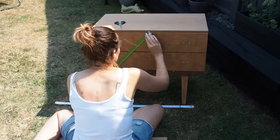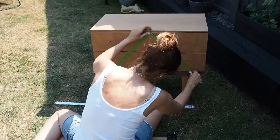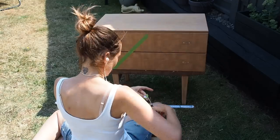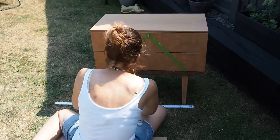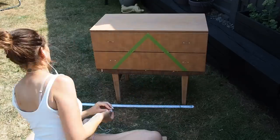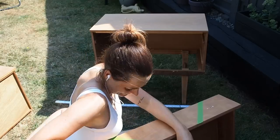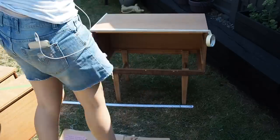I'm going to paint outside of the triangle and the inside of the triangle is going to remain wood. To make sure the triangle design lines up I'm drawing it out with the drawers in the unit. I measured, found the centre, marked approximately where I wanted the triangle to finish, and then marked it out with masking tape. Once I've got my design where I want it I'm going to slice the masking tape so I can pull the drawers out and paint them out of the unit. I'm also going to mask off all the way around the top so I don't get any paint on it when painting the sides.